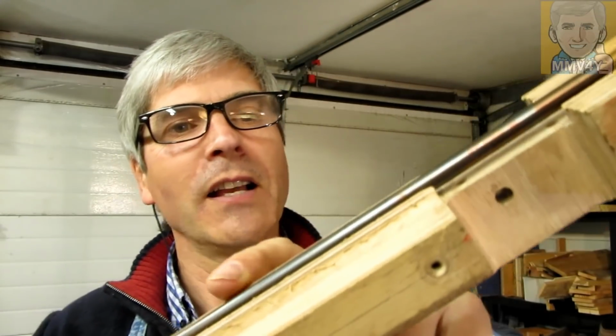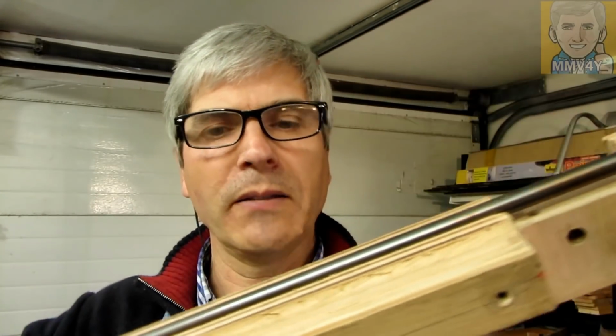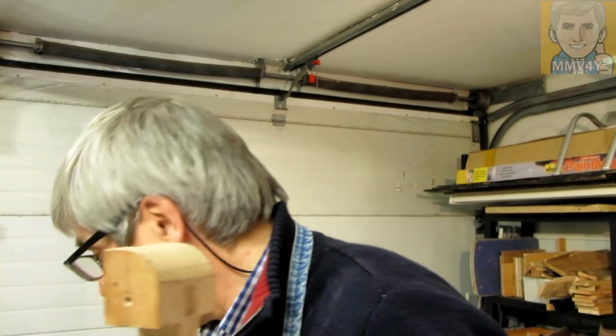Just a very quick update about cutting this top face. As you can see now, the shaft is sitting above. It's almost half of the diameter above this face. The only problem is that this material is so tough and the blades get so dull so quickly. And in the beginning I was making a little bit heavier cuts and that didn't work at all.